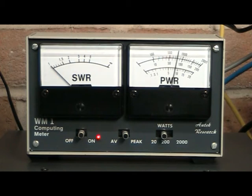The nature of a PEP meter is that it captures those speech peaks, and it's often peaking up to 150 watts, occasionally pinning out at 200 watts. So that's our 10 foundation watts as indicated on a PEP watt meter.